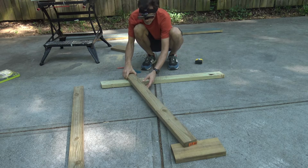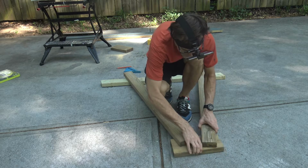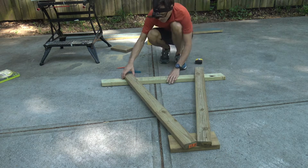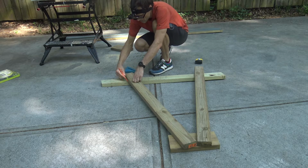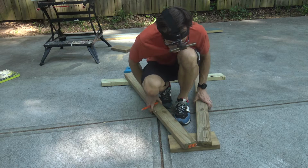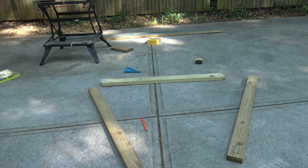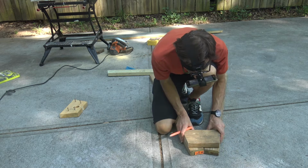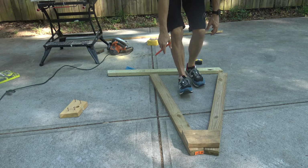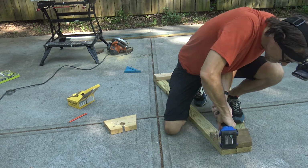Now place one of the 1-foot boards on the ground with the ends of two of the 4-foot boards on top. Place the marked 3-foot piece beneath the 4-footers at the other end with their ends flush with the bottom of the 3-footer. Move the 4-foot boards until their inside edges line up with the marks. Trace the spots where the boards overlap, and these are going to be your cut marks. Do the same for the other set of boards. Screw or nail the two trapezoids to assemble.